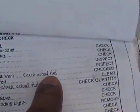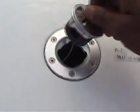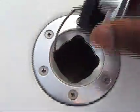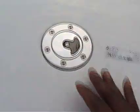Make sure it's secured on there. Tire — that's the tire right here, it looks properly inflated. Step — that would be this right here. Make sure the screws are in, it's secured — you don't want to step on it to get inside and have it break. Tank drain and vent check — check the actual fuel. The indicator said 13 gallons, but on the left wing you can see there's no fuel showing in the sight gauge.